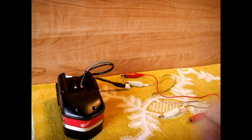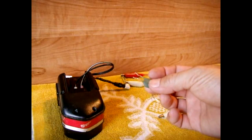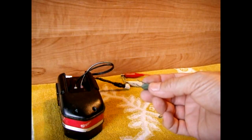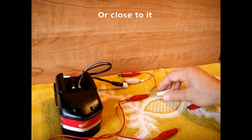I'm going to connect this 12-volt power supply to a 1-amp 12-volt bulb from a car dome light, connected to the inrush current limiter. You're going to see it start out slightly dim when it starts up, and as the thermistor heats up and gets hot you're going to see the light get brighter — that's when the resistance drops and you're getting full power.